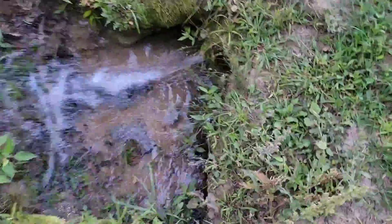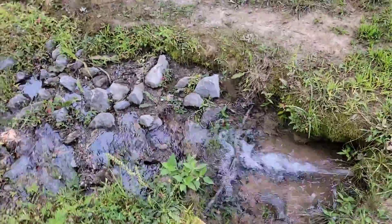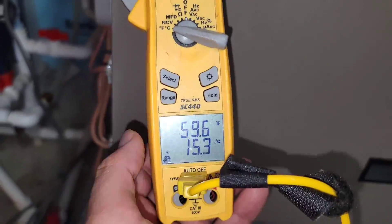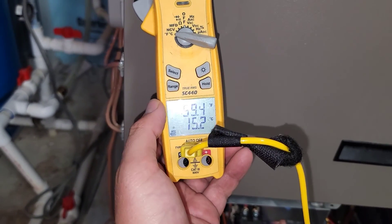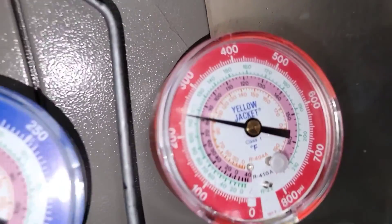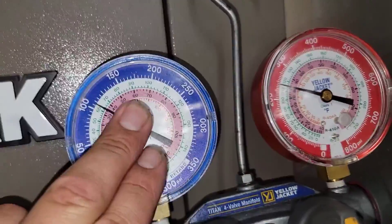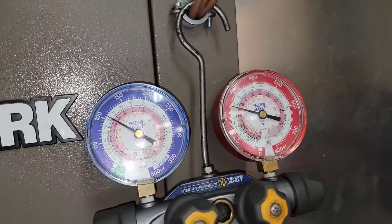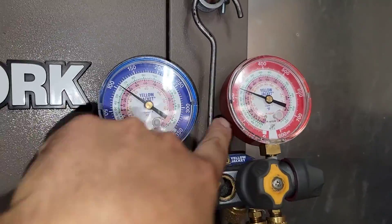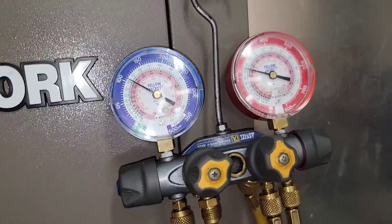Here's where the water dumps out, probably 200 or 300 feet from the house — pump and dump. Liquid line temperature is 59 degrees; that seems a little low to me. 59 — that's really low. I need to make sure it's in second stage; it may just be in first stage. I always need to check the charge when it's in second stage because these pressures will dramatically change when the compressor is pumping at full capacity.